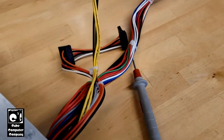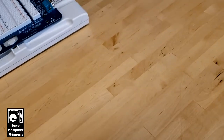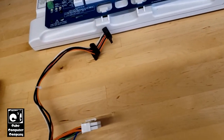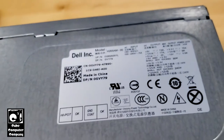I'm filming with my phone, which actually takes a little bit better video than the camera I normally use for the channel. It's kind of hard to see in there, but this one may or may not have some bulging caps. I have like four to six of these units exhibiting the exact same problem. I thought maybe a simple recap would fix one, but I tried recapping one with fresh brand new capacitors, and that did not fix the problem.